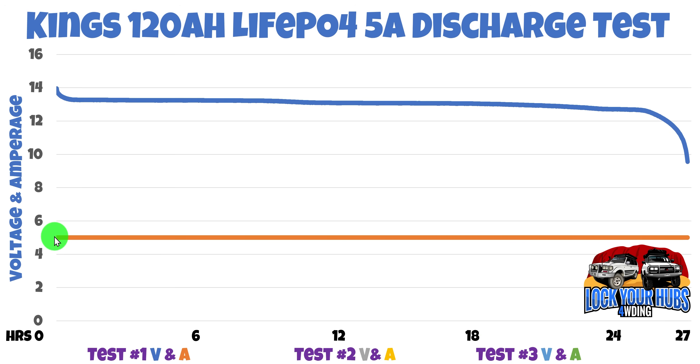First test. You can see the amperage right from the start to the very end, a consistent 5 amps, and that's consistent amongst the three tests. Only the voltage changes. You can see the voltage remains very, very consistent right from the beginning — about 95% — right through to about the 10% mark. The reason it's great is because if you have resistive loads, something like a travel buddy or maybe a road chef, the voltage you're putting into that resistive load is very, very consistent. That's great, except when you're trying to assess the state of charge of your battery. You can't do it with a conventional voltage meter like you could a lead acid, because they drop off consistently. What you have to use is a shunt, which measures the amount of current going in or going out, and will tell you exactly how much capacity your battery has left.